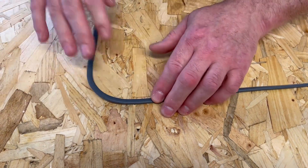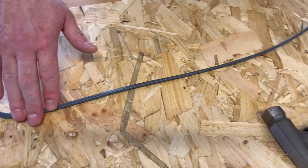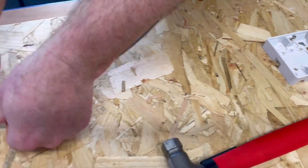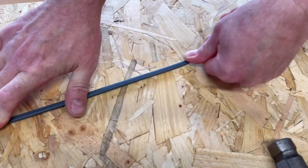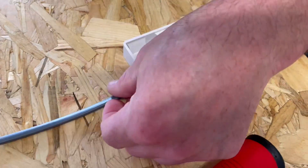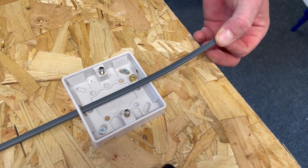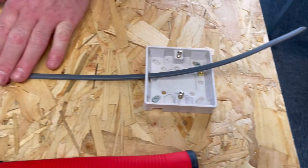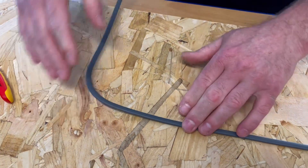In this case we've got a light switch box that we're going to put it into. I'll take my side cutters and shorten this cable down a little bit. I've cut it, drag it again, and then pop it into the box - making sure I don't scuff my cable. We go into the box and about a box length longer than it was - box length plus another box length. So the cable is pretty much into position, pretty flat.